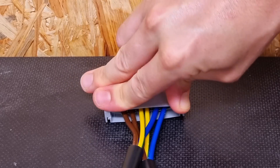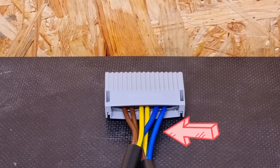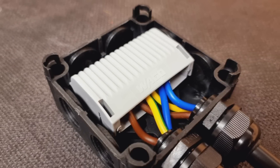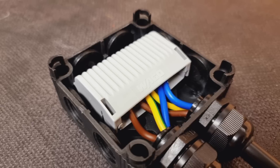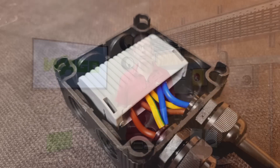which means that when it's installed as per the instructions, there'll be a section of conductor with insulation and no sheath. And this needs to then sit inside an enclosure to stay compliant with BS 7671. So the gel box provides IPX8 protection to the connections and the enclosure provides cable retention and protection to the gel box, conductors and cable.